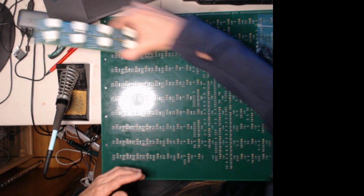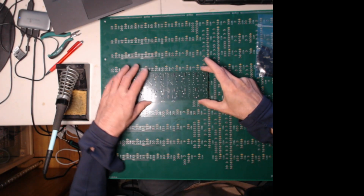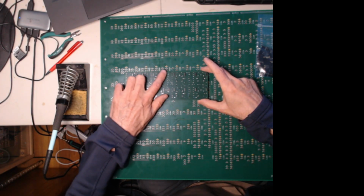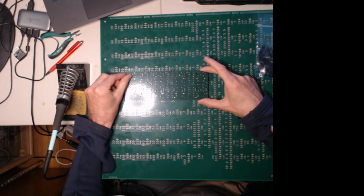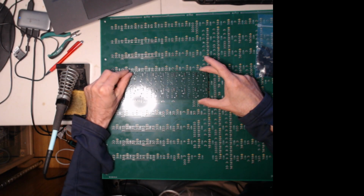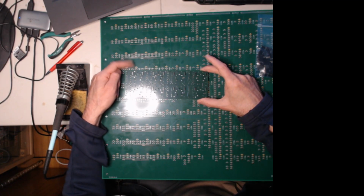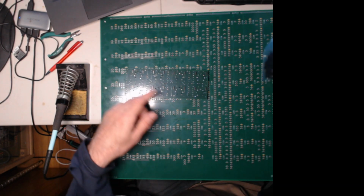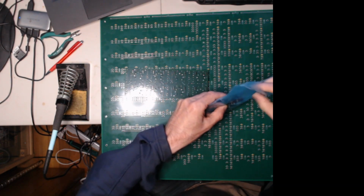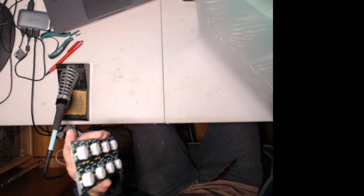These two boards plug in the back here, and so they have these 3-pin connectors, one connector per gate. So there's the gate pin, the grid pin. Then there's a power pin of some sort, ground or +5 or one of the high voltages. And then on the top of the 3 pins is the output from the voltage dividers that go to the plate. So what you want to do is put these connectors on the back here.